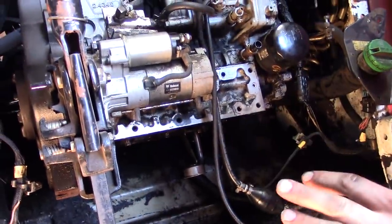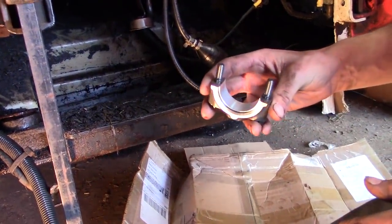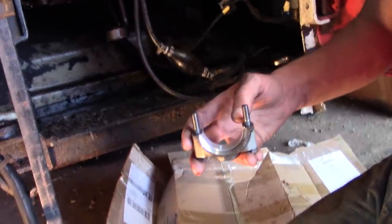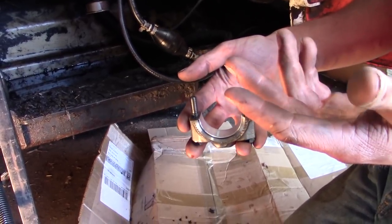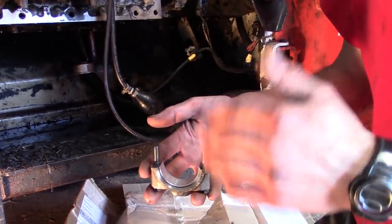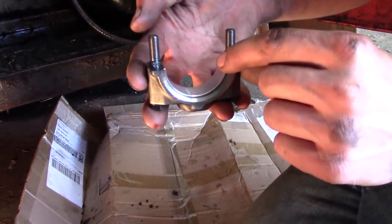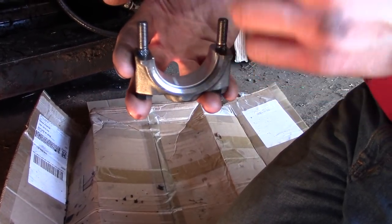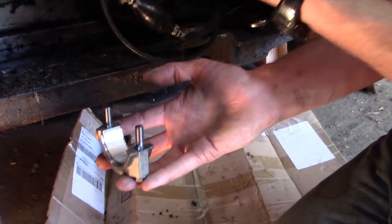So we're going to clean this off. I'm going to oil this, push the piston back up, oil the crankshaft journal, and then put this cap back on, torque it back to spec, and then we'll move on. Put the oil pan back on. Because it's within spec, it looks good. What happens if it wasn't in spec? You don't have to use PlastiGauge — it's just kind of one of those double-check things. It's always recommended because things could be wrong. As this is the new connecting rod, I wanted to make sure it's within spec. I'm reusing the original bearing — this silver insert. Some people always use new bearings, but I view it as it's not spun, it's already worn to the crankshaft. The crankshaft has 7,000 hours on it, it's already specifically worn in that specific direction to the crankshaft journal. I'd rather not change that.